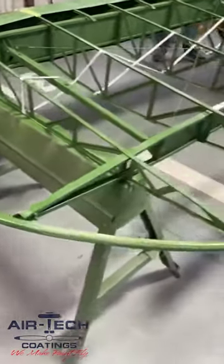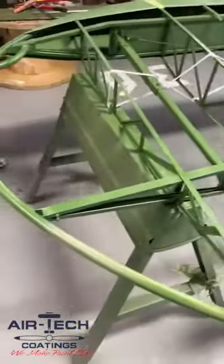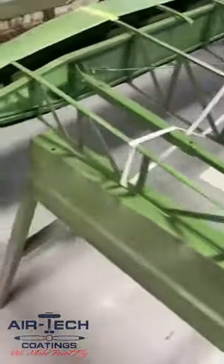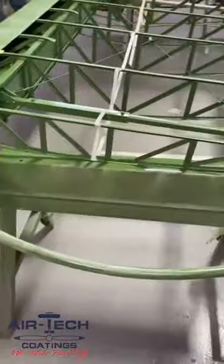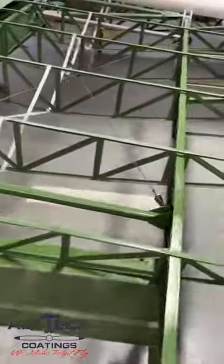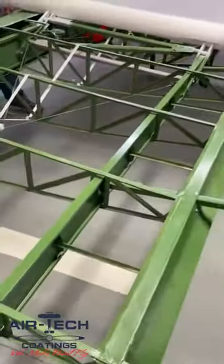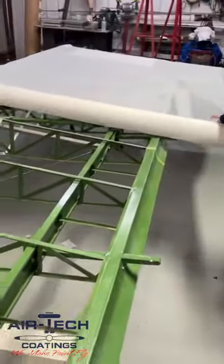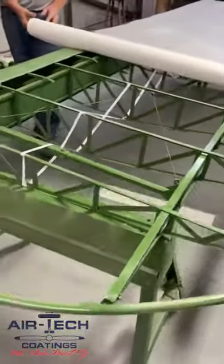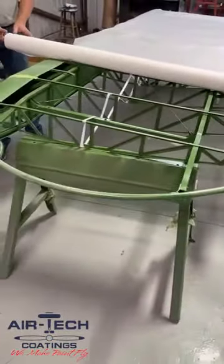There are people that try to cut it and use a minimal amount of fabric. And that's fine if they can get away with that. But I'll use a little extra fabric. It just makes it easier. So we're going to get it rolled out, and then we're going to measure our trailing edge, the measurement we took a while ago, and mark the fabric, and then use alligator clips and then start tacking with glue once we get the fabric laid out and squared out on the wing.